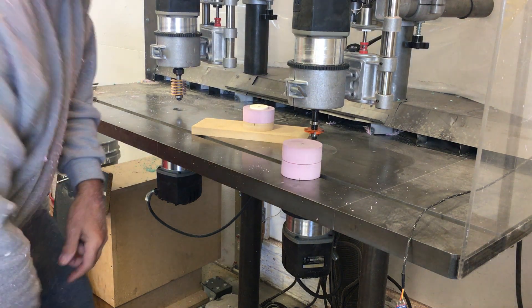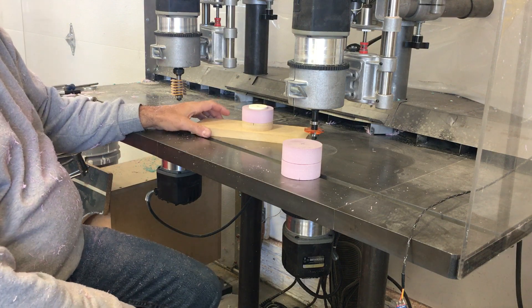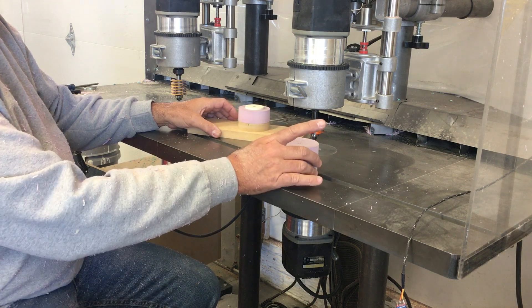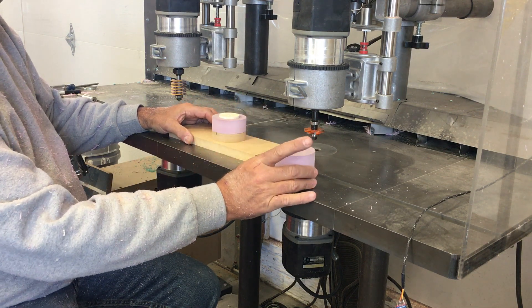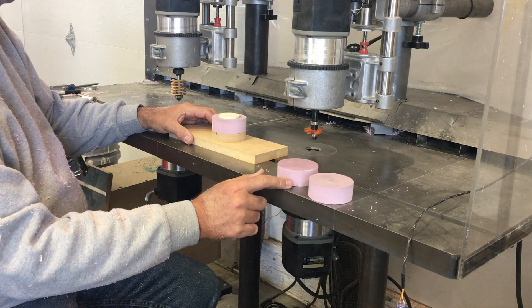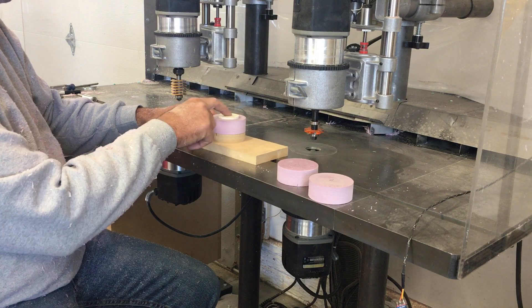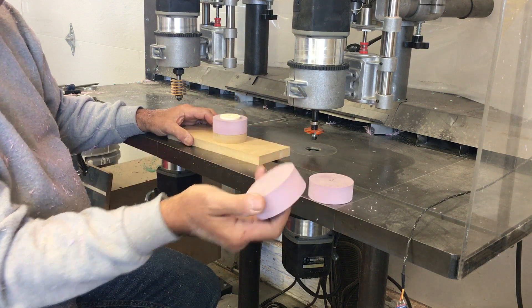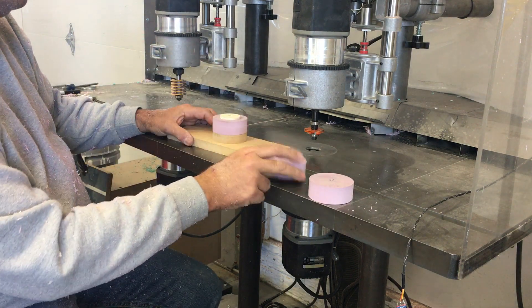This is the second and third operation of the head that goes on the cylinder. I grip this one a little differently since it's a tougher piece — there's not a real convenient way to grip it, so I just put a screw right down through the center of it. It makes a small hole that's easily patched with just a little patch of wax or something.